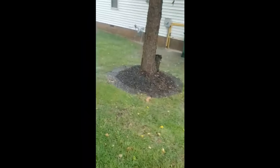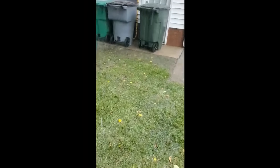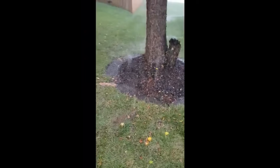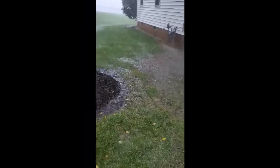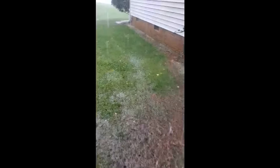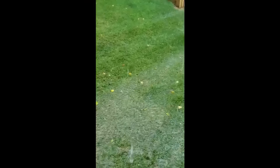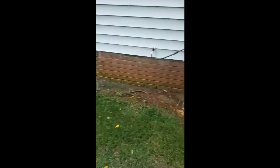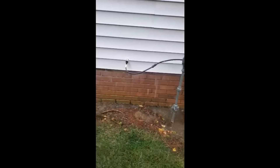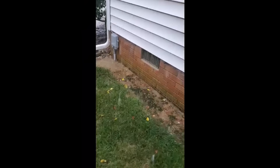Once the water gets to that area around the driveway — here's a good look at it. Now that tree right there has been removed, so you'll see that. And look at the trash cans there, that's another good landmark — you see all the water under the trash cans. All this water is hanging up against the house, up against the crawl space, and that's why the homeowner called me. You can see there's a little bit of a swale already in the land, and we're going to dig that swale out and throw it up against the foundation here. You can see how green it is under that foundation vent well — that's just standing water right there up against the crawl.